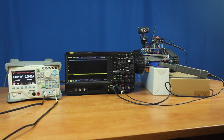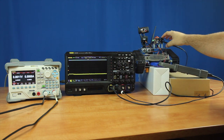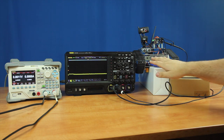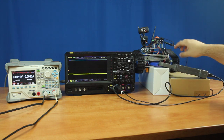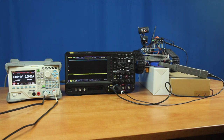In order to capture our operational power draw from our battery, I've got our current probe already connected to channel 1 in yellow, and I've got our voltage probe connected to channel 2. I've set our robot up on a stand just so the tracks can freely move without it moving, just to make this test a little easier.